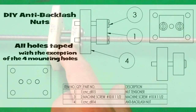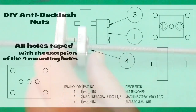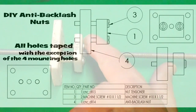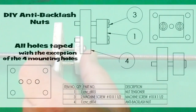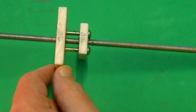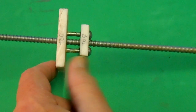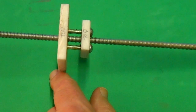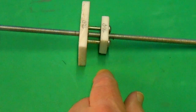You want to put some mounting holes in this piece and make it bigger so you can get your screws in and mount it to your axis. These bolts here are threaded in both pieces — I actually threaded this piece and this piece, so it's not just a through hole. These are actually threaded, and then these screws pull it apart. By adjusting these bolts I can put more or less tension. This material is similar to Delrin, which is self-lubricating.